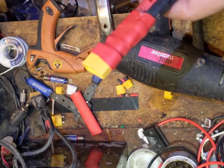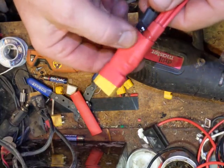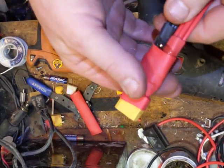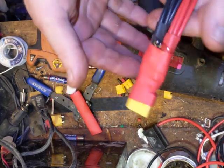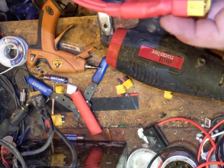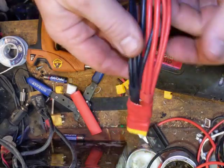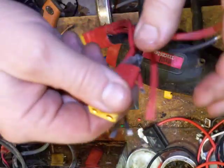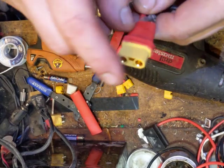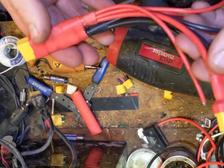I'm building this for the camera for folks at home, so it's not the best work, but it's okay. That'll cool. This will help hold everything in place — it's hot right now so it's flexible, but when it cools it'll be a lot harder. This is not PVC heat shrink; it's a different material that stands up to temperature better and has more similar characteristics to the silicon wire. But mainly I wanted to do this to show you how to put a low voltage, standardized, polarized, covered connector on your wiring harnesses — so that you have a way to connect to your 12 volt system.